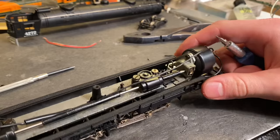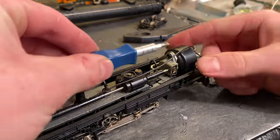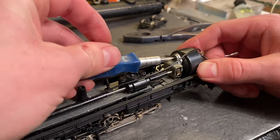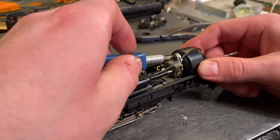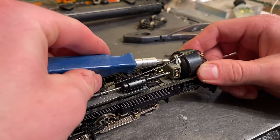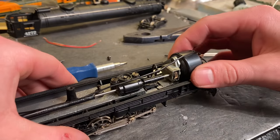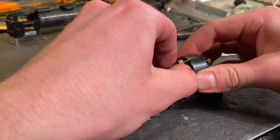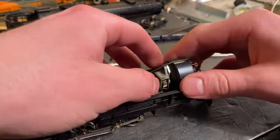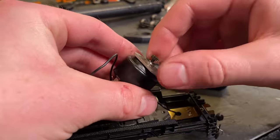Well, I'm pretty confident at this point we've solved the shorting issue, but I'm a little bit concerned about the motor's condition, so I'm just going to take it off the whole drive here, and I'll service it, you know, oil the bearings, clean the commutator, and hopefully that will solve whatever the issues with it are, because it does start, it's just the torque is very, very low. It could also relate to the drive, which I intend to service as well, but, you know, these motors, if they have a lot of hours on them, there will be some issues usually with the commutator. Yeah, that could probably use some cleaning too, honestly.